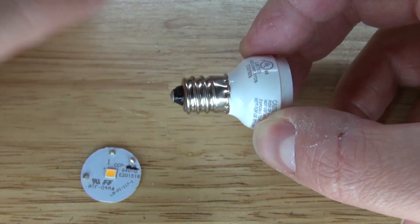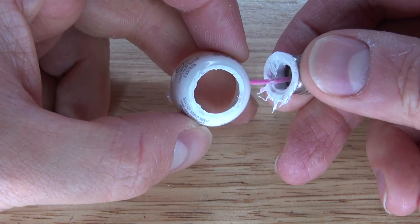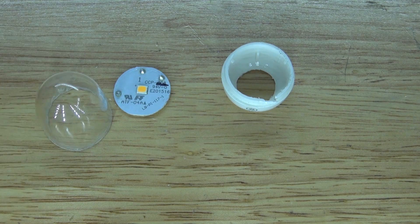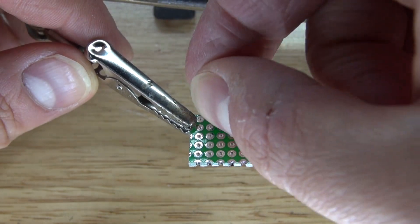What I need to do is cut off the bottom part because I do not require that portion. I only require these parts that came from this LED lightbulb. Next, I'm going to take my perfboard and place my BC547 transistor into position.